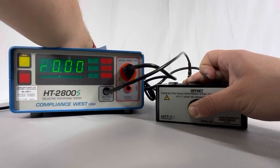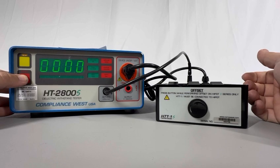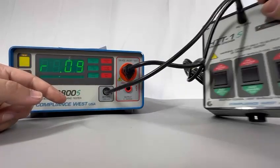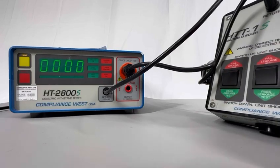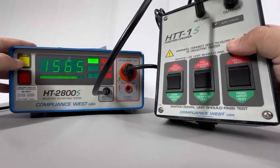I'm going to recheck it again — you see, now it's on zero, that's what we want. The 0.03 reading is because it's not on short anymore, so that's fine. By the way, the HTT1S ground has a limit between 0.025 on the pass position and 0.13 on the fail position, which means I need to put my ground setting limit between those values. As you can see, I have it on 0.09, which is between those values.